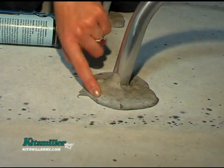If you go up there and seal the cracks before water gets into the wall, you won't have any hidden water damage. Generally by the time it shows up on the floor, you've already got a really big problem that you didn't know you had. So wash it, dry it, then start looking along the seams.